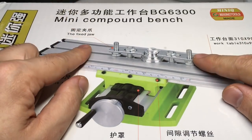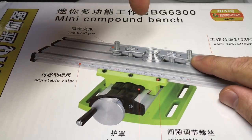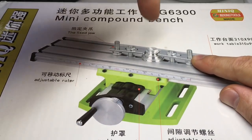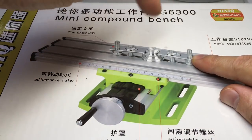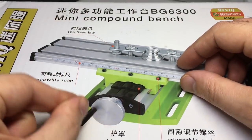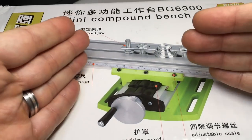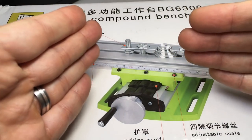Either way, it's a very useful tool. Why would you want this? Well, if you imagine you've got your drill press drilling down in the same spot, either you have to reposition the object you're working on, or you can dial these handles in so that you can just move it to the next position a lot more accurately.